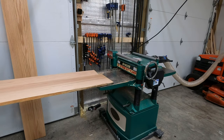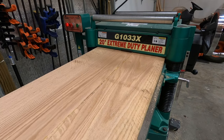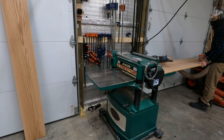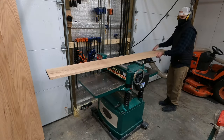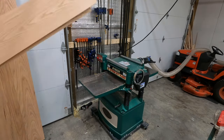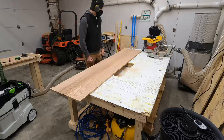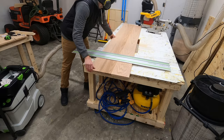A nice set of digital calipers is extremely useful for the next step, which is planing the headboard and footboard down to the proper thickness. If too much is taken off with the planer, that panel may be seated too loosely in the groove. On the contrary, if the panel is left too thick, it could cause the outside groove tongues to crack, essentially breaking those leg pieces. So it is extremely important that the panel is the exact same size as the groove, or as close as you can get it.